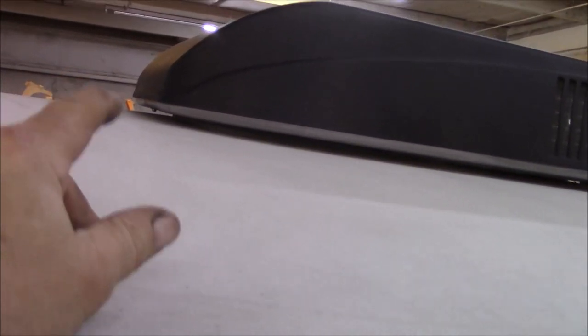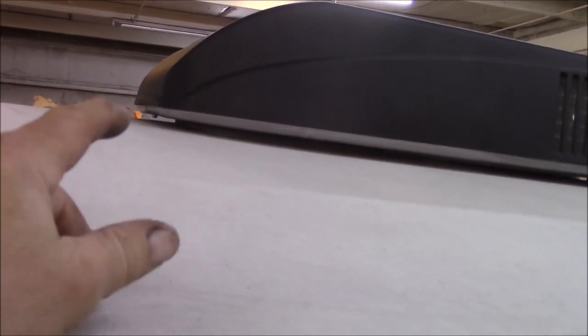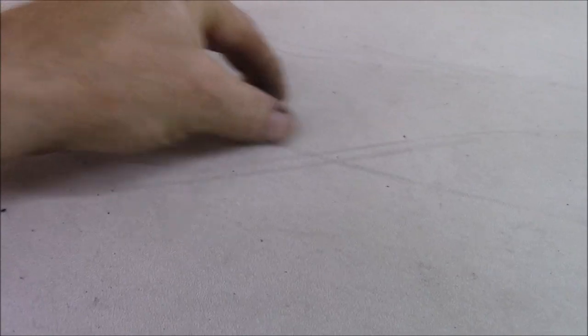That's it. And the other thing about it is they use cheap gaskets, so instead of having them punched out as a square, they don't. They have this piece glued to this piece, glued to this piece, glued to this piece. So now you got four corners that are potential leaks. But other than that, it's your typical RV roof. Like you said, slobbered, more on. You can see right here.